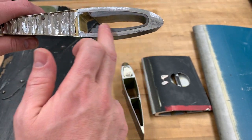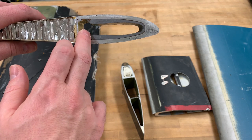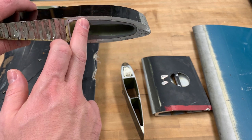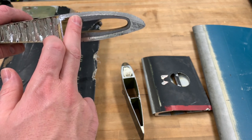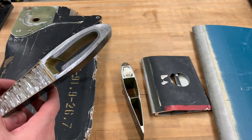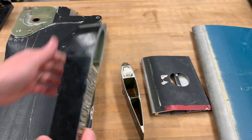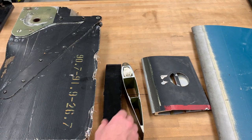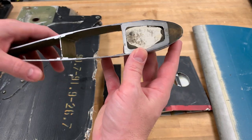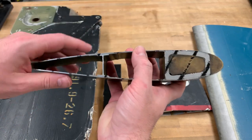In this case, this is only a certain part of the blade. There's an inertia weight added in here, and that inertia weight is to give the blades some inertia during autorotation to keep them turning. Because the actual blade was too light, it was slowing down in the absence of engine power, so they had to give it some inertia. Similarly, that's also a brass mid-span weight.